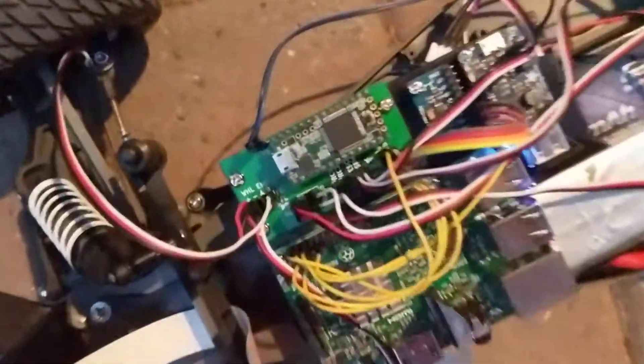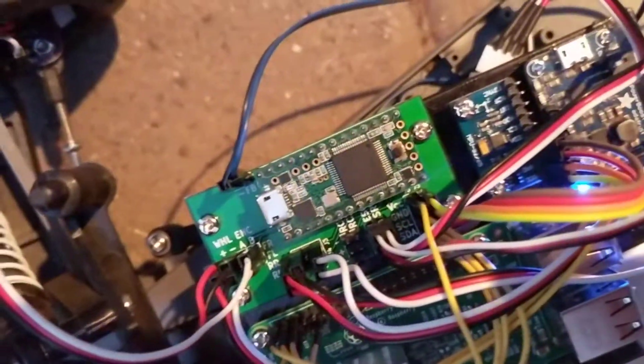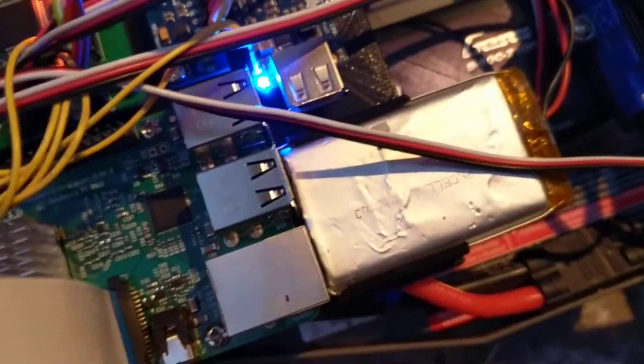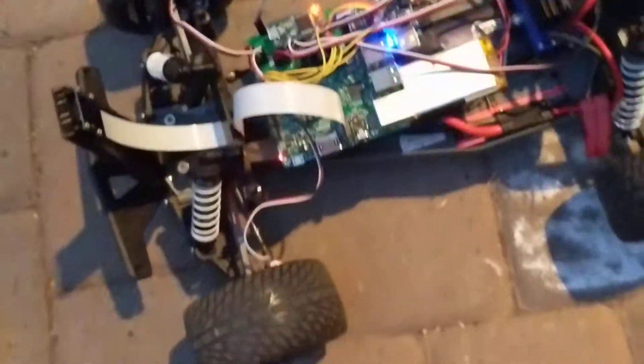Here's my hardware. This is a custom Teensy board which connects to the wheel encoders. I've got servo feedback too, so I know exactly how fast this thing's turning when using servos. There's a battery boost controller, a lithium polymer cell from Adafruit, and the actual car battery is this giant monster over here — it's like 9800 milliamp hours. Raspberry Pi 3. Regular Traxxas Rustler car.